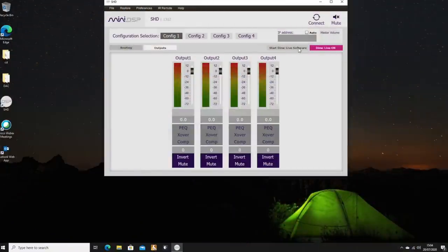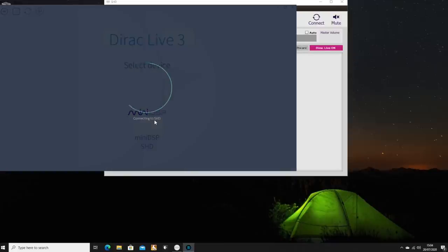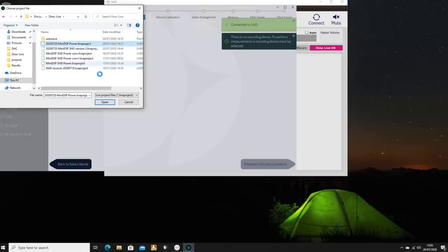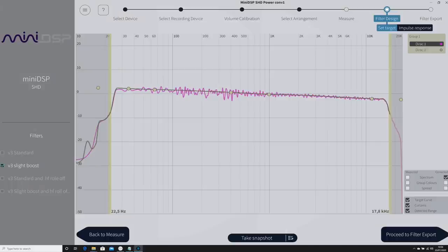To set up Dirac Live room correction, download Dirac Live from live.dirac.com and install it, then start it from within the SHD plugin. The MiniDSP SHD will be found — just click on it and follow the instructions. You can buy the SHD Power with or without the MiniDSP UMIK-1 measurement microphone; I advise including it for the extra $50. Download the calibration file unique to your microphone from the MiniDSP site and link the Dirac Live software to it. The measurement procedure is straightforward — just follow the on-screen instructions. The real trick is to use a good target curve; you don't want a fully flat curve. Dirac Live has a commonly agreed-on target curve as a standard.